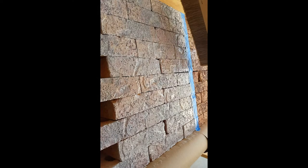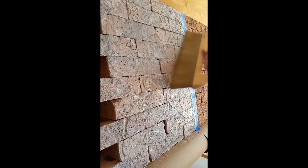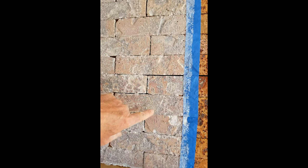Now it's time for us to brush. Brushing application is simply random. I don't want to present a pattern. I don't want it to look like I worked on a little two-foot section at a time. So randomizing the movement allows you to do just that. We can see now that the brick looks very smooth — we don't have the dimpled effect from the roller. This looks nice and even. We're going to leave this in this condition and let it completely dry out. The application calls for this first coat to cure at minimum 12 hours so that when we come to it the next day, we won't be able to move this paint around.